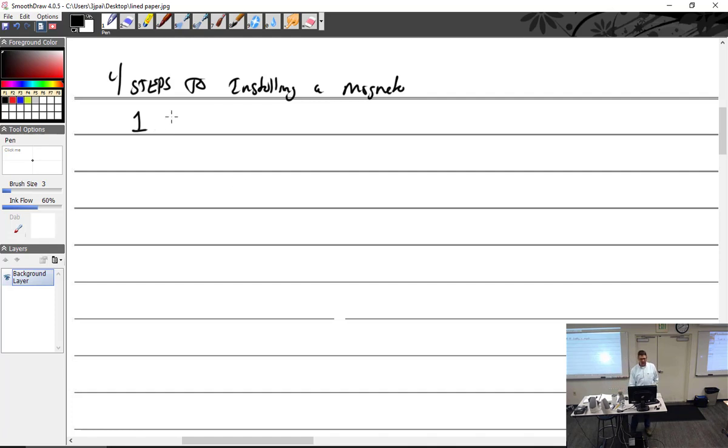Put the engine where it's supposed to fire. I'll be more specific: number 1 cylinder should fire. And where is that typically going to happen? Before top dead center. Before top dead center is exactly correct. Somewhere between 30 to 25 is pretty common.